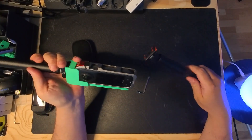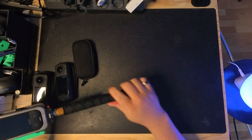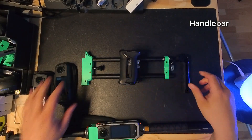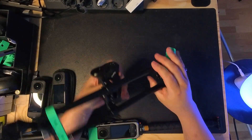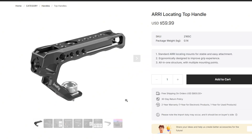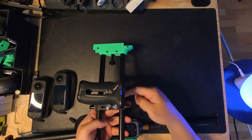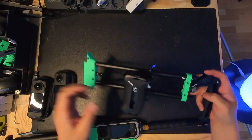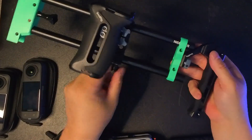With this I was able to place the top and bottom extension rods very quickly without screwing them to the mounting piece every time. Now that the vertical arms are in place, we can look at the handlebar itself — the largest single part of the rig, assembled from ready-made camera gear parts mostly made by SmallRig, accumulated from older projects. The handlebar is made from typical 15mm rail rods, convenient for attaching all kinds of adjustable parts, such as this handle whose position I can easily change and tighten to where it feels most sturdy.